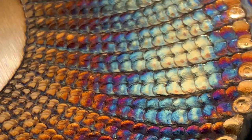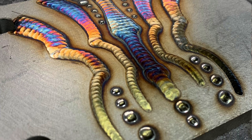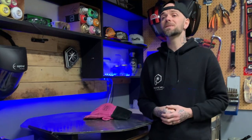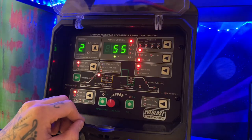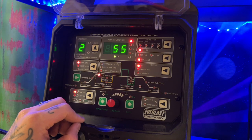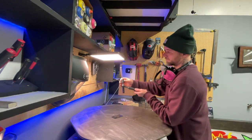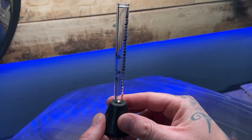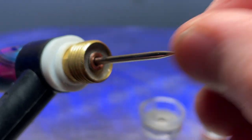Let's go over some stuff that's going to get us the best results and some crazy colors. A lot of people assume it's about having the best gear and really good settings — this sometimes helps, but today we're keeping it simple. Firing up my Everlast machine, I'm setting it for about 55 amps on straight DC negative for stainless steel, and my gas will be set for approximately 30 CFH. The main thing I'm going to focus on is my torch setup, running a basic gas lens.